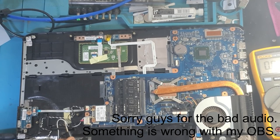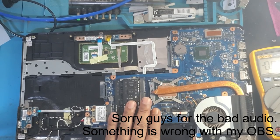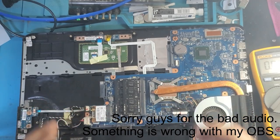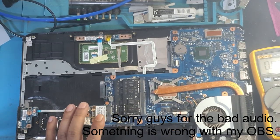and then we will check the main power rail of 19 volt, which is also here. But let me take the board out, because I don't see any MOSFET for the first and second MOSFET. So I suspect the MOSFET is underneath. To get access to that MOSFET, I have to remove this board first and then flip it, and then we can have a look. So I will pause the video. Let me remove those screws and stuff. Probably this heat sink is also going to come off. When I'm done, I will start the recording again.